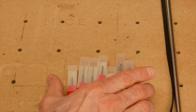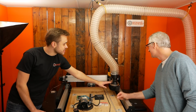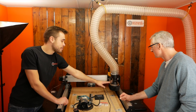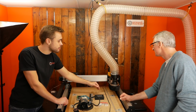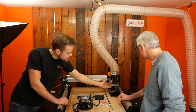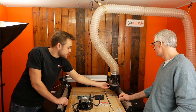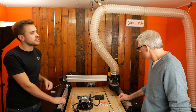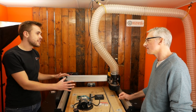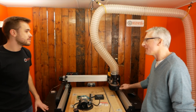You've got a fairly serious-looking dust collection skirt. So this is another option we do — the dust shoe. It's actually a good project to make on your own machine, but if you want to start off straight away, we supply one. This just disconnects magnetically, so you can easily change your bit without having to disconnect the shoe — just put it back on. The brush is especially made for CNC applications, because if you use really hard dust shoes, when it's going over your bit it can end up moving it around. So these are nice soft ones.